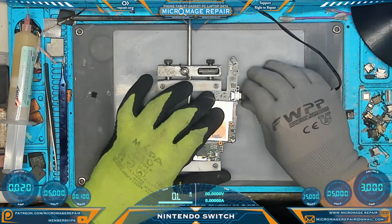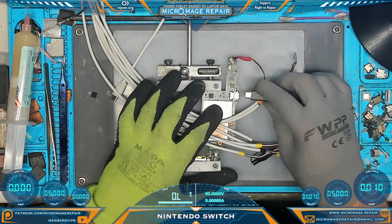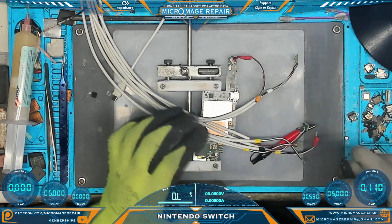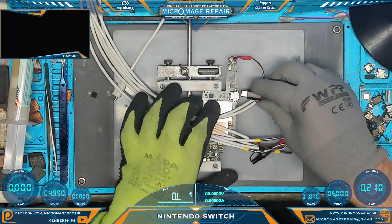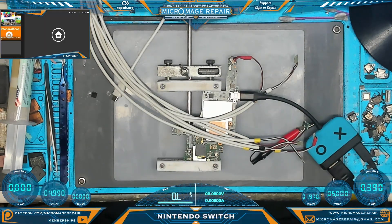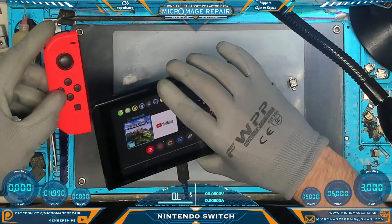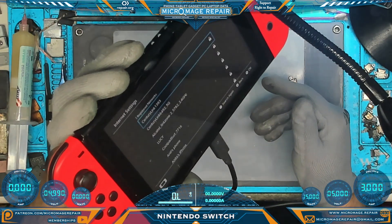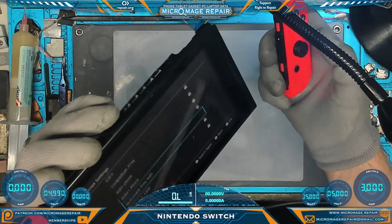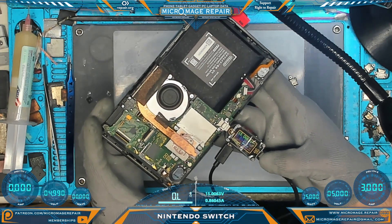We're getting it on both sides - that is a good sign. Now we've grabbed our modified iPhone power squid, which we've retrofitted with Nintendo Switch battery connectors, and we're going to plug in our OEM charger for quick activation. What you want to see here is steady current draw - once it goes steadily up without hanging, it appears to be booting. We're going to use our dongle and see if we are docking, which is the big test here - and we are! Wow, that's excellent. 20 ripped pads and we got it on the first try. We're back up and running on its battery. Performing a few quick tests: joy-cons are seen and charging, it's seeing the networks, it's seeing Bluetooth. The fan is spinning and on the USB meter we are pulling 15 volts at 0.86 amps - we are fast charging. Excellent.